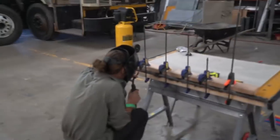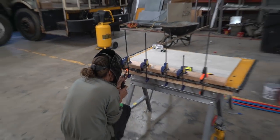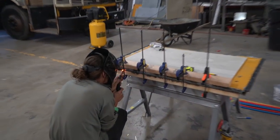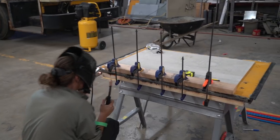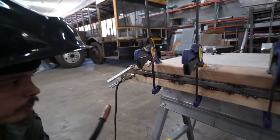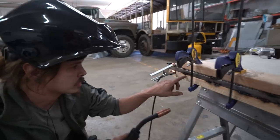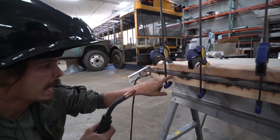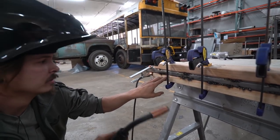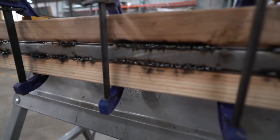This is the correct way to weld sheet metal to box iron. Looks like you have to go piece by piece. You're gonna want to do it just like that — you can't stay on it continuously otherwise you'll blast through it. Pretty much aim for your gap, let it penetrate good, stop, move over, let it penetrate good, and you can keep a steady pace all the way through. That is a lot better looking than what I did over there.